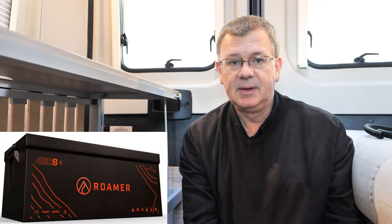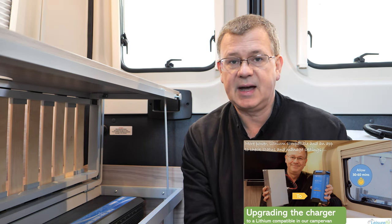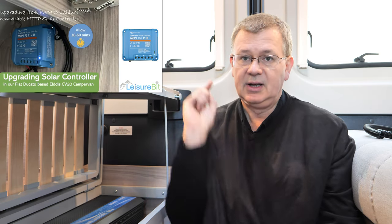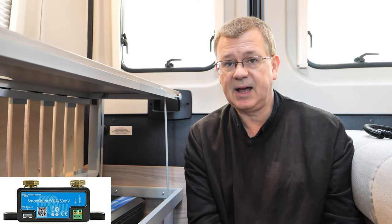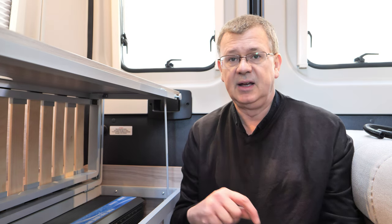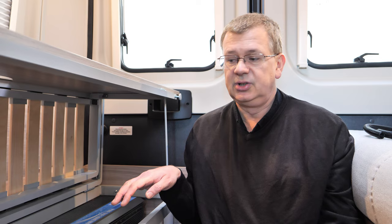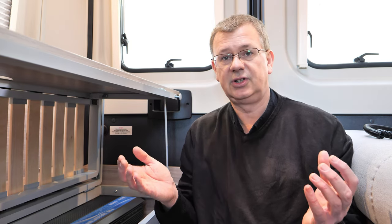The battery is 460 amp hours. It's charging from the Victron mains charger — if you watched the previous video — and there's also a connection from the solar controller which feeds down from above. I've got a smart shunt as well just to keep an eye on the power. I'm also fitting an inverter, which we'll cover in the next video, and then we'll do a subsequent video bringing it all together — how everything connects and a 'so what' video covering how much power things use and how much capacity you really need.